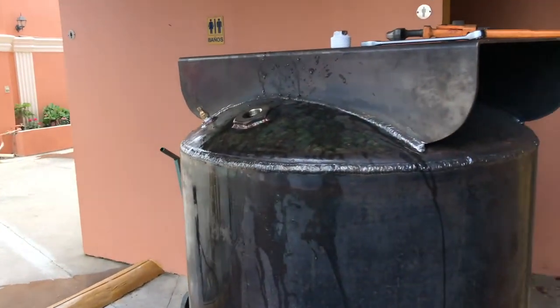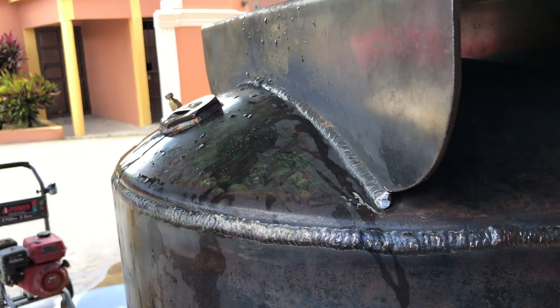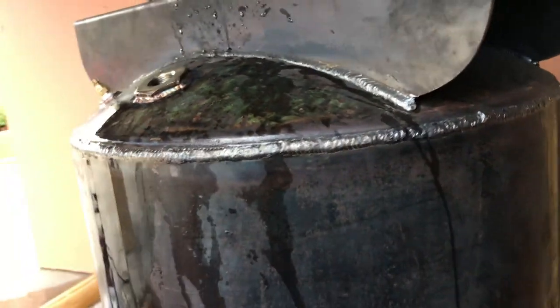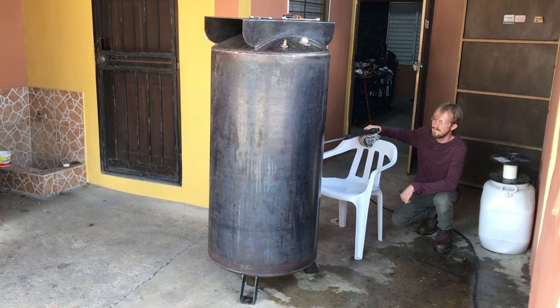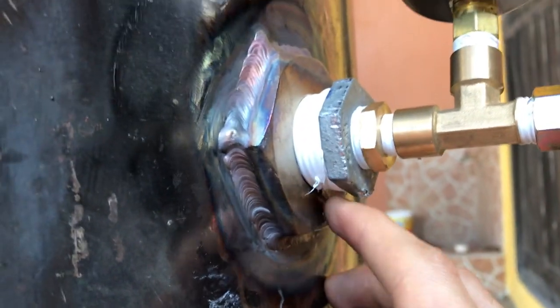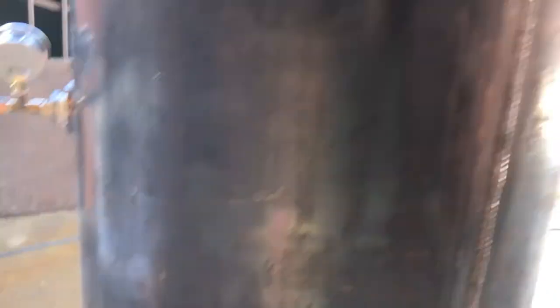Try two — we've got the pressure washer hooked up. I replaced all the fittings with 304 stainless and TIG welded them in with stainless filler. I have a level system; there might be a dash of air in the top which is probably not ideal, but the tank weighs about 800 pounds so I can't tip it easily. At 220 PSI it's holding pressure fine — we got one little drip on the Teflon, but everything else is holding fine with no drips, no pinholes.